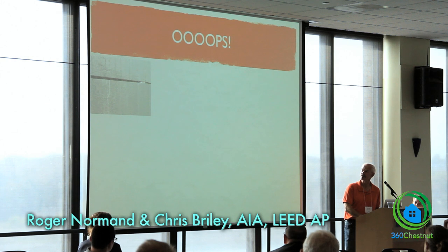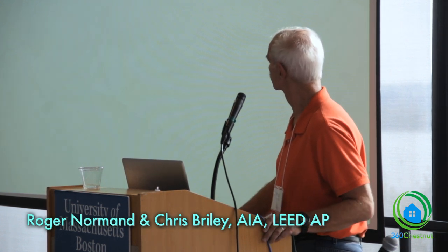So we had separation like this on the pour in a lot of places. That's uplift. The problem is when you pour concrete, well, the ICF is foam. Guess what? Foam is lighter than concrete. So there is separation, not properly braced, whatever.